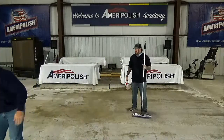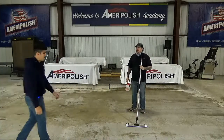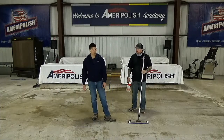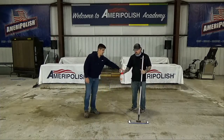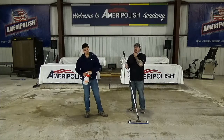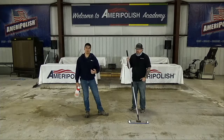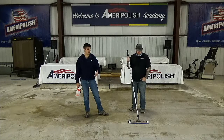And the idea is to keep the floor wet for 10 to 15 minutes or to the point of rejection. So I'll spray it, Gary's going to microfiber, and we're just going to try to get it to the point of rejection. We have to keep in the back of our mind that this is the demo slab we've used.